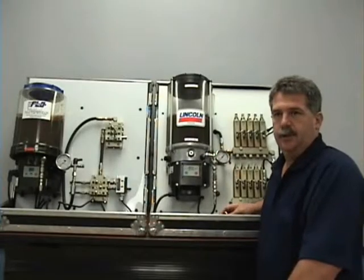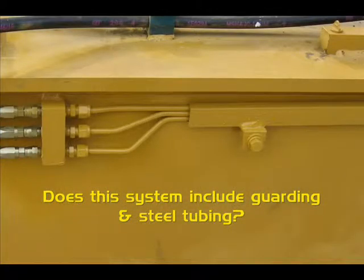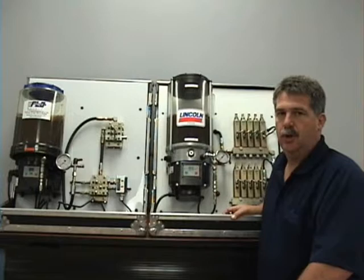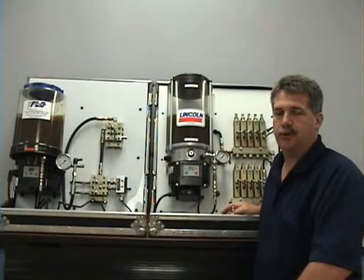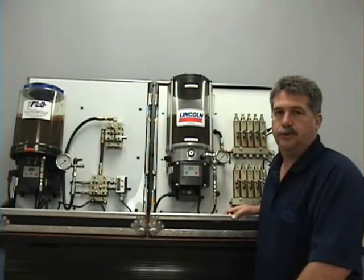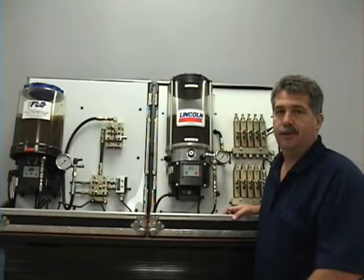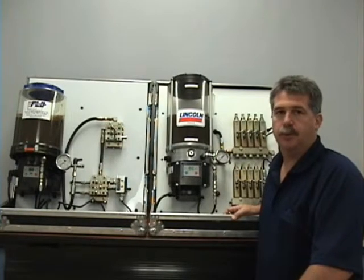Another question to be asked is whether there is guarding and steel tubing installed on the lube system. As you can see by this picture, ideally you would have steel tube with guarding over top and standard compression fittings — this makes your system readily field serviceable in case of problems, line breakage, or blockage. By contrast, the use of super tube or welding the steel lines right onto the booms or structures will make field serviceability very difficult, because welding, torches, and grinders are then required.